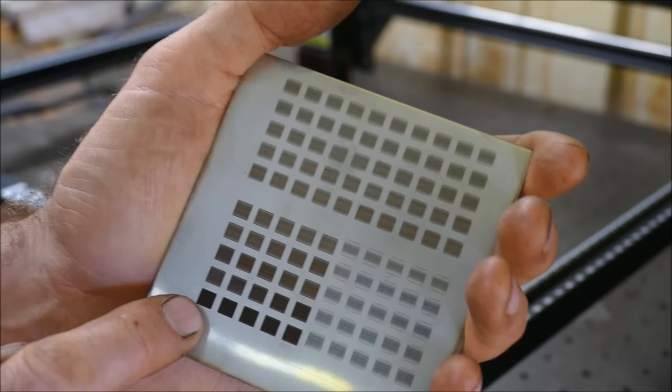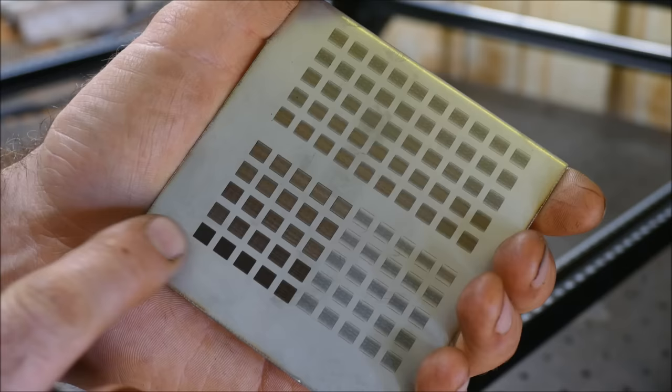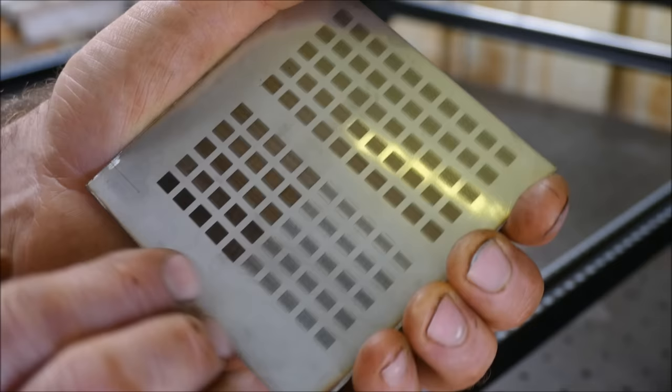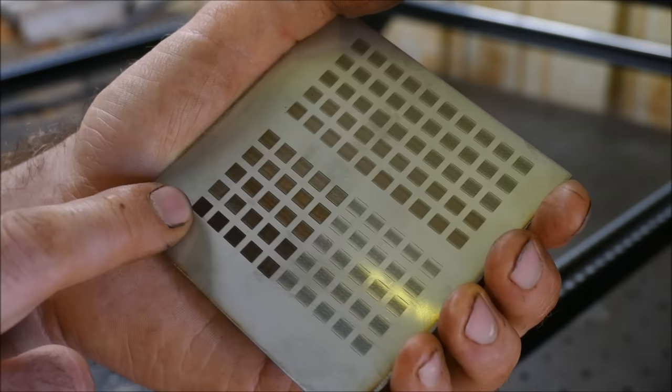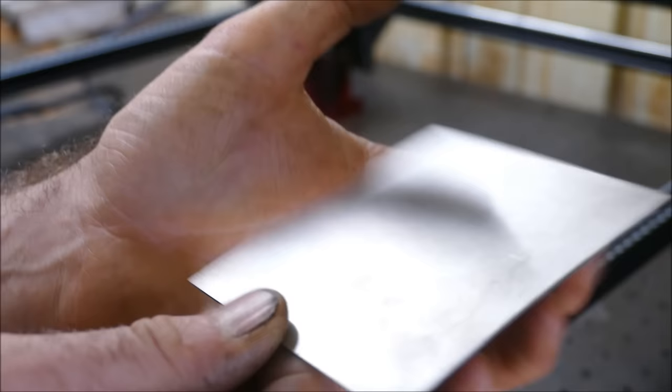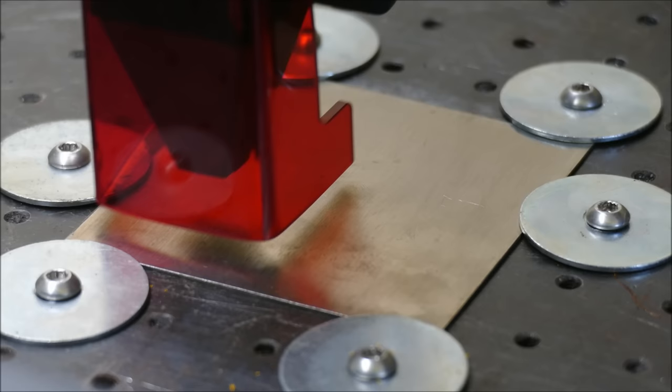What you're seeing here: I started at 1000mm per minute at 100% power and increased every division by 100mm per minute, so by the time it reaches the other end we're at something like 8000mm per minute. I was hoping to get some temper colours but that's not really the case, though you can still get different hues. If you wanted something multi-layered like a greyscale, you can definitely do it with stainless steel. I think I'll stick with 1000mm per minute and engrave my maker's mark.